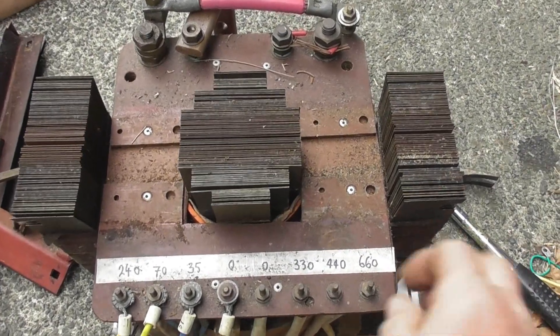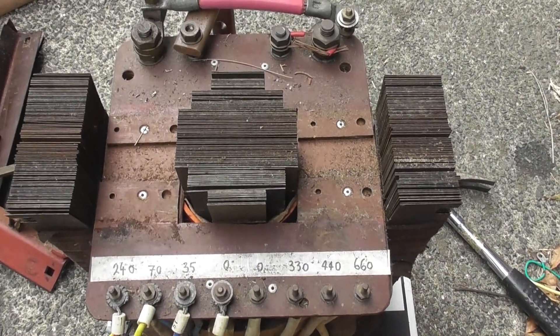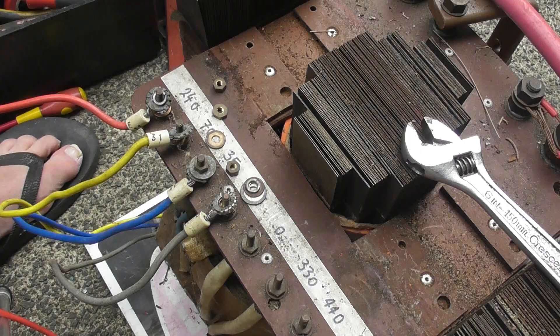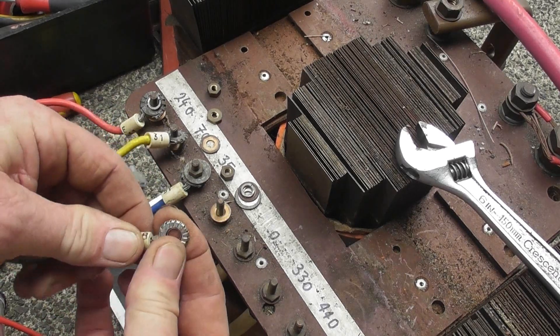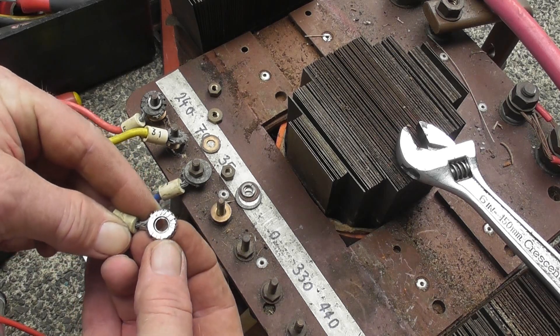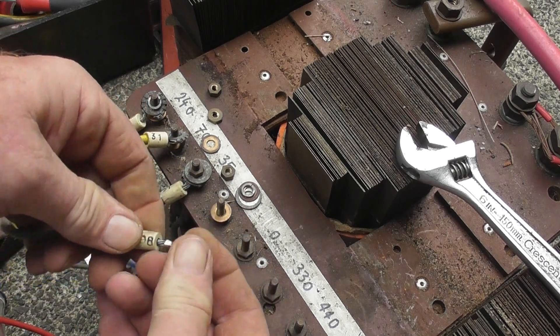Okay, that's how she looks. Take the wires off, take the plate off, get access to the winding. A good pack of the blick packet — in Dutch we call it blick packet — laminations, transformer core laminations. These are really cool lugs. The wire gets put in a loop in the channel, and the washer gets put on top of it, and then these end pins get folded over. So it's actually a really good electrical connection.